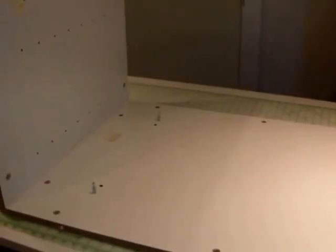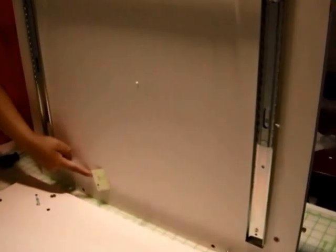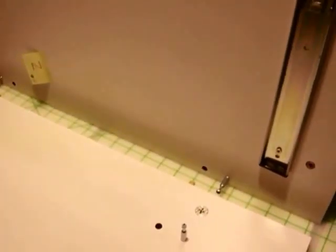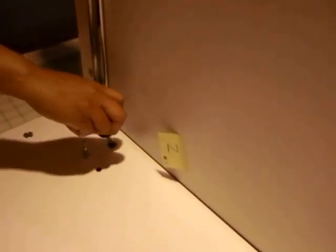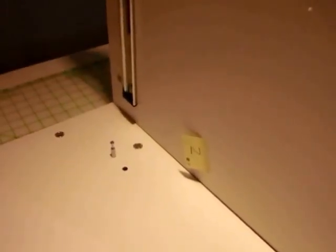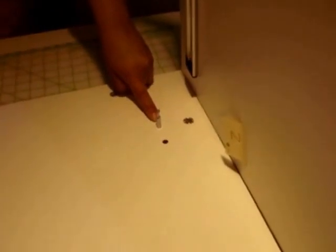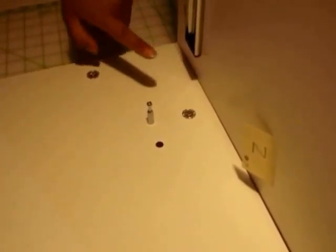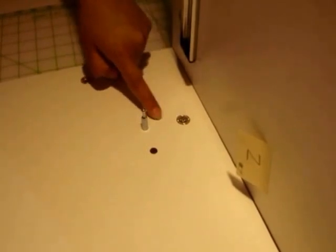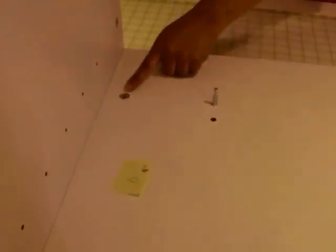Step 4: take your X panel, D panel, and Z panel. Take your cam bolts, line them up with the cams, and slide them in. Then use your screwdriver to turn the cams and lock them into place. It is very important to pay attention to orientation: on the right side where you attach panel Z, there is a much shorter distance between the cam bolt and the cam on panel D. On the right side it's a short distance; on the left side it's a much larger distance.